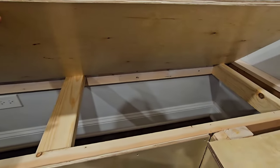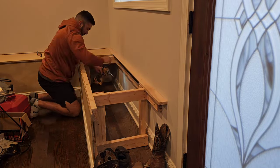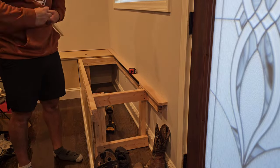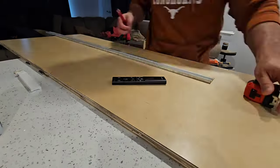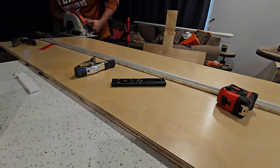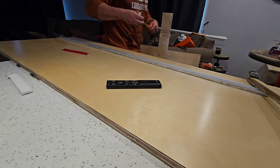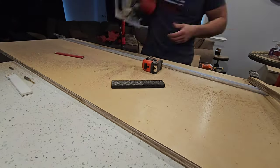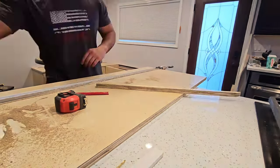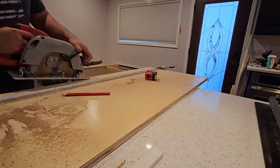This lid does not look too bad — it gives me a nice little lip. Now we can lift it up — oh there it is, that's how it's going to look. Now we get into the nitty gritty: we're going to be attaching the actual hinges on here. As I mentioned I found these on Amazon. The quality of these hinges in comparison to the ones you find at Home Depot — night and day. Definitely recommend these from Amazon, and you can cut them to length. I'm just arranging my clamp so I can cut it with the circular saw. I had to use that little piece of wood there on the right just because this piece of metal is not long enough to fit from one side to the other. This provided such a nice clean cut in comparison to the jigsaw — definitely recommend a circular saw, and obviously if you can cut it outside, cut it outside.